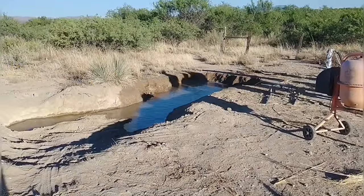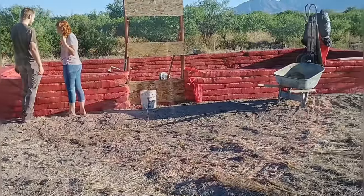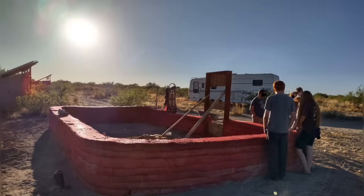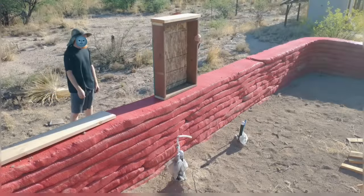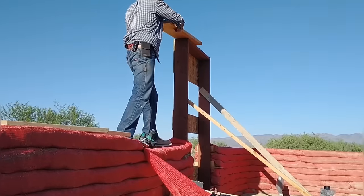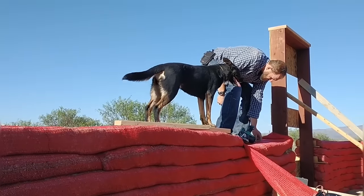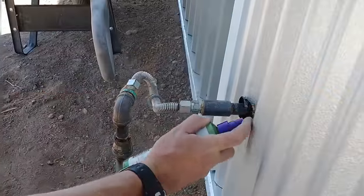Here's a quick look at our son's hyper-adobe build. You can see he's collecting his dirt from this area, and the excavation will actually become a pond during the monsoon season after the build is over — a double purpose. He's coming along nicely on the walls and he's up high enough that he's ready for a window, so I helped him build a window frame. We also put a 12-inch board on top of the door frame and window frame for added width and reinforcement.